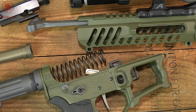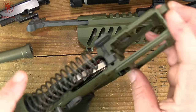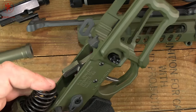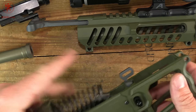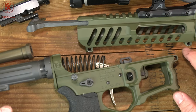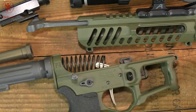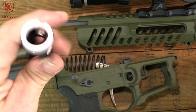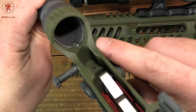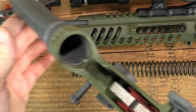Where am I going wrong? Where could the extra friction be? Everything fits smoothly, the upper is assembled correctly. We could be running into friction coming over this Rise Armament hammer, but it's a pretty angled, nice path. So I don't think this spring is putting too much resistance to move the carrier back and forth. The upper and lower fit so tightly, especially after Cerakote, that you pretty much have to pound it all together to get the pins in, and then nothing's moving. In manually cycling it, I didn't see, hear, or feel any friction — it's not like this is slightly out of alignment and whacking the tube. The PWS tube has a nice extension there to help provide support and reduce carrier tilt, and we don't see any excessive wear in there.